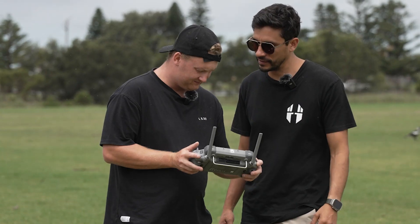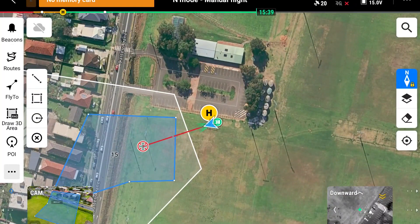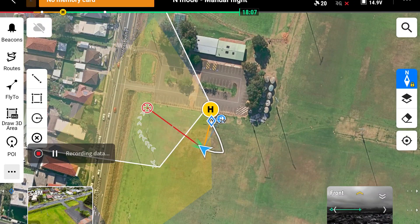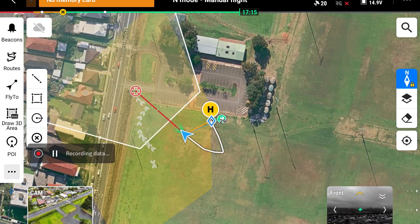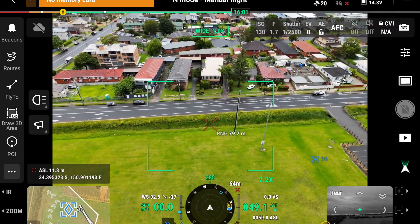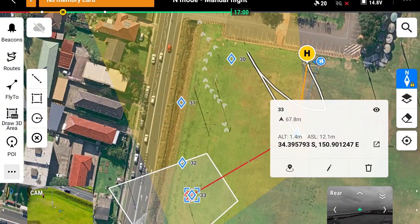The AR overlay on this thing is super powerful to see what you're looking at. We also have the ability to drop pins using the laser rangefinder — it's plotting where you've actually looked in the direction. So if you're doing search and rescue, you have the ability to push that out so you know what the coverage was. If you're focusing on a subject, it'll show you the direction of where the subject went and exactly where it's going. So you can drop the pins on the ground and generate annotations for locations. All of these map assets can be pushed out as standard GeoJSON or any other format into a GIS platform — a very powerful tool. You can even make the drone go to these locations and reset your home to those positions.